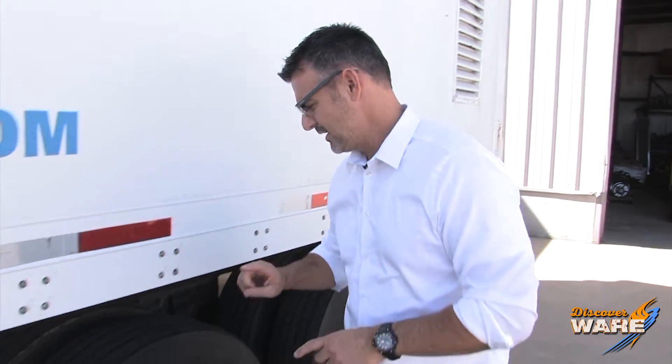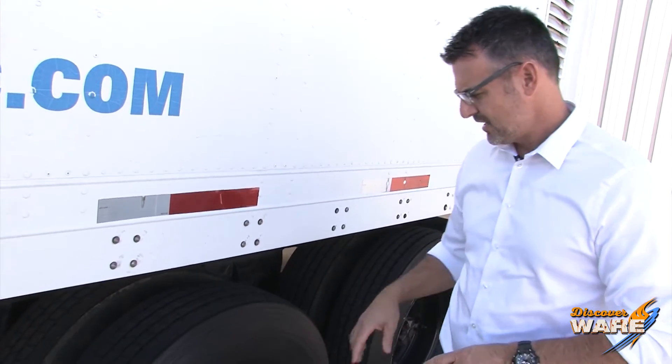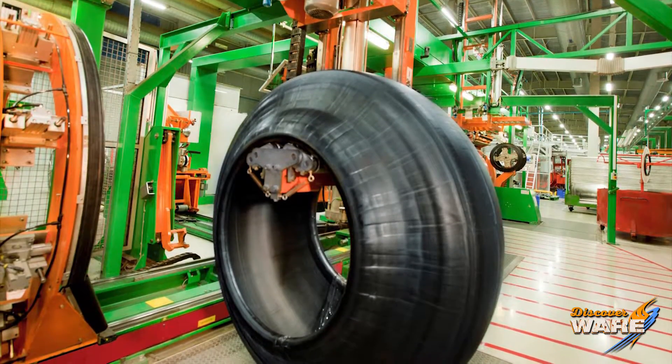From that concept, he learned how to mass-produce tires with the use of vulcanization. Now, a quick step forward into this process — we have a tire. When they form the tire, they build it all up, but it doesn't have any tread in it — it's bald. In the industry, that's called a green tire.